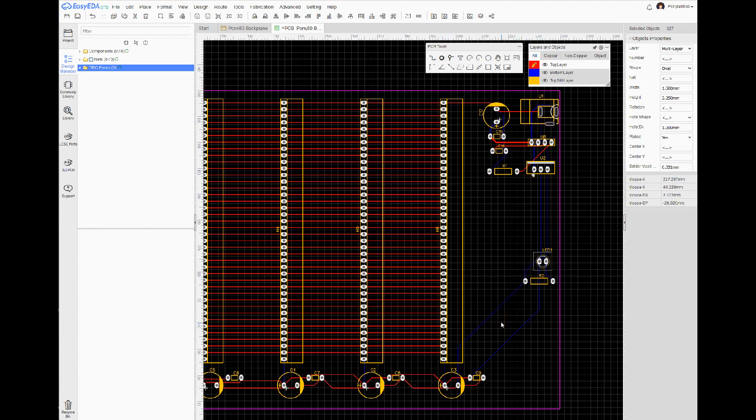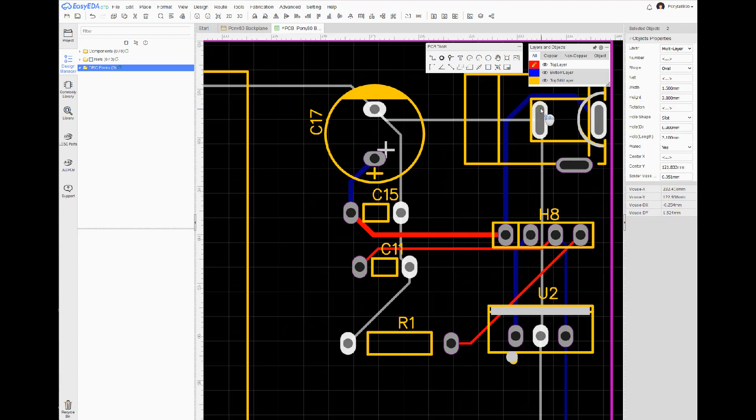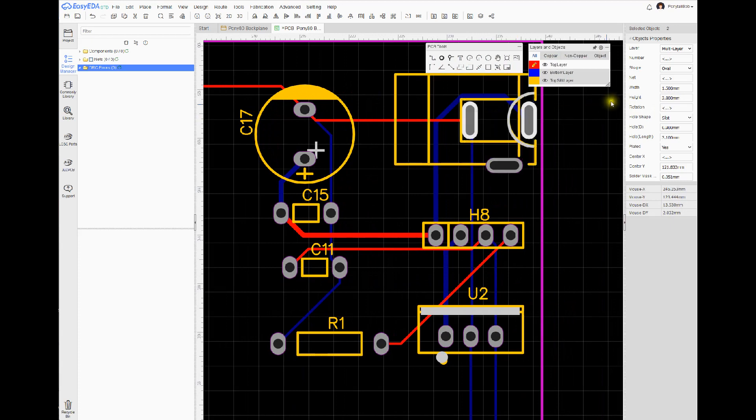The reason I like this is that when soldering, everything is exactly the same — I don't have to worry about pads being different sizes. For the power plug I want to go ahead and change those separately. Let me select them one at a time — right now they're 1.5 by 3.8 — I think that's a little thin for soldering, so I'm going to bump the width up to 2 millimeters.